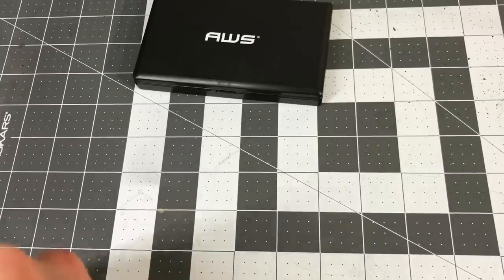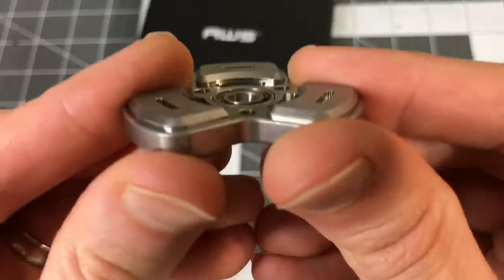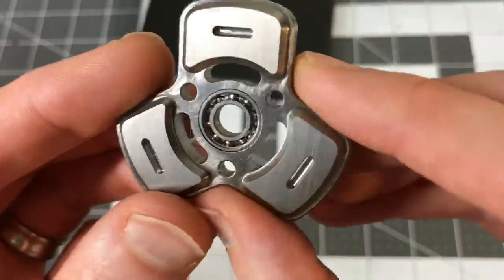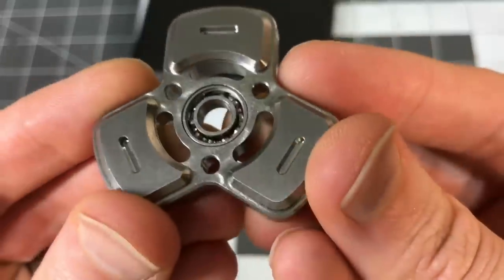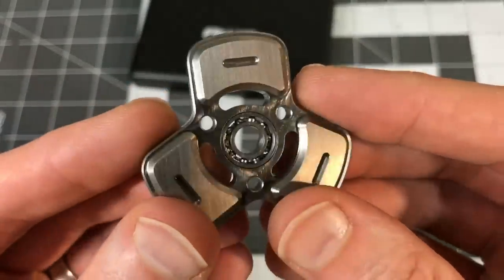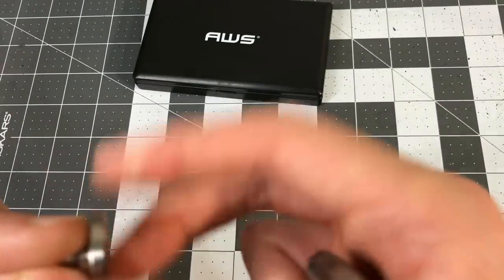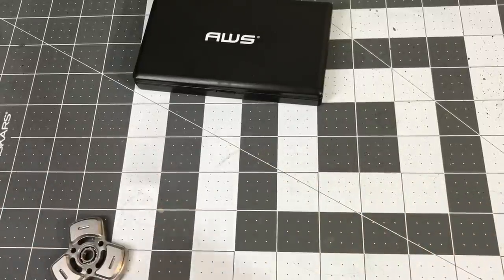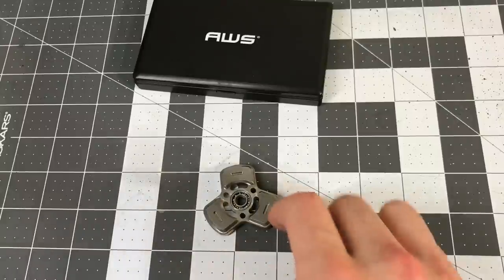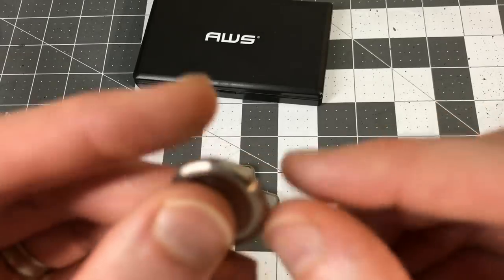Look at that — doesn't that look sweet! It comes with a shielded bearing, and I believe it's glued in rather than press-fit. There's no retention method, so you'll need a bearing removal tool or something the right size to push it out. I deshielded it because I needed to clean it. It's a hybrid ceramic, and I'm not sure why you'd have a shielded hybrid ceramic — because hybrid ceramic is going to polish and wear out the insides, so you'll have to take those shields off to clean it early on anyway. But it seems like a really cool bearing with a great feel.